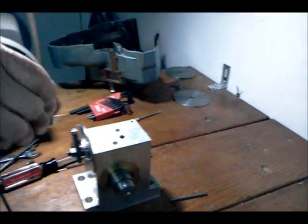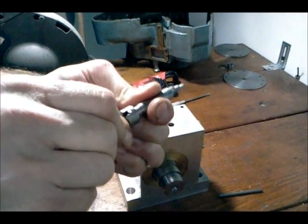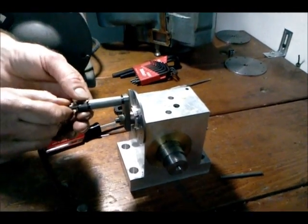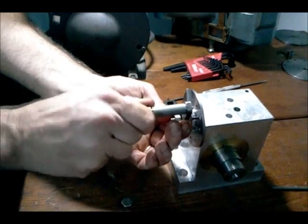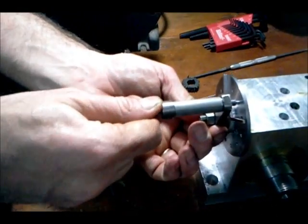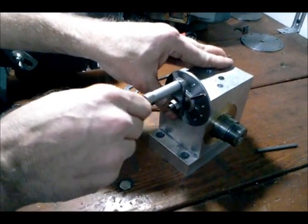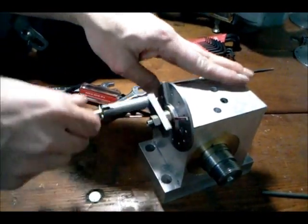I also have a crank pin that I made from carbon steel — it's got a spring inside and a pin so I can engage and disengage it. The sleeve just goes over and lets it roll freely. I can put my crank pin screwed into the crank, set my distance so it goes right in the hole, and then tighten down on this nut. You can see that it will engage, or if I want I can just turn it freely. Right now the worm is not engaged.